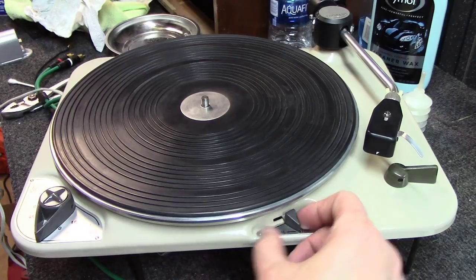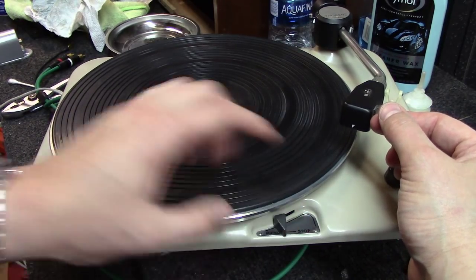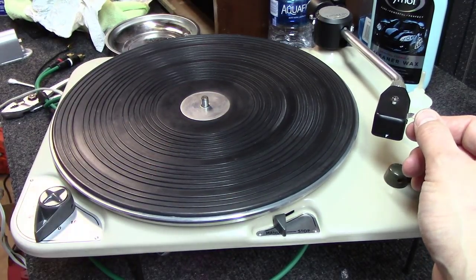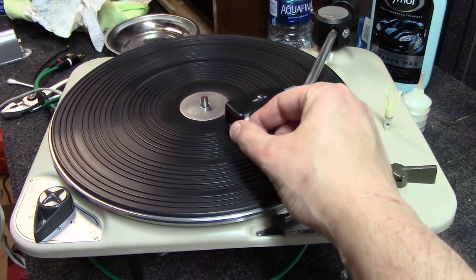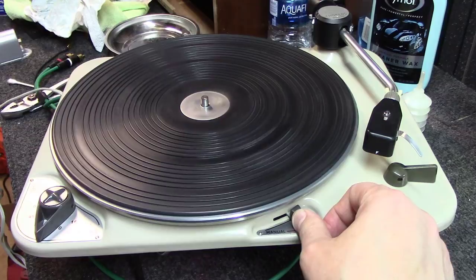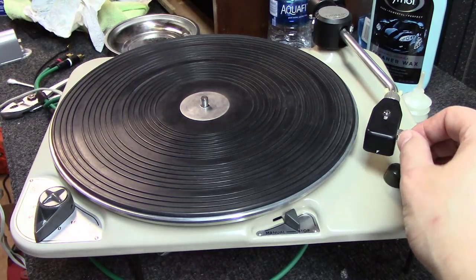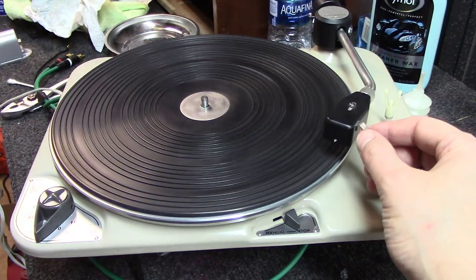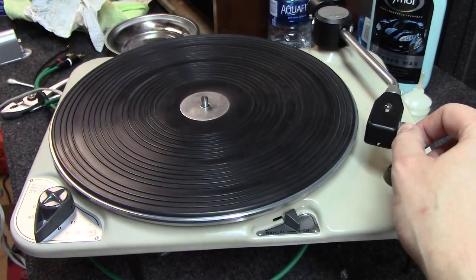Manual is just a little bit different here. The way manual works, oops, sometimes you have to spin the platter a little bit to get it to go over on manual, because the catch lever here that was cutting the table off still was engaged. But you would do the thing where you turn it on by moving it over to the right. You drop your needle, it would play through. It will not shut off when it gets to the runoff groove then. You would have to bring it over here, and you would have to manually flip this over to the stop position. So most people just leave it on the kind of stop function there. Sometimes you have to spin it just a little bit to get it off of that flip point. Table will turn on, drop your needle, it'll play through. Gets to the runout groove, table will turn off. You can move your needle back over and store it.